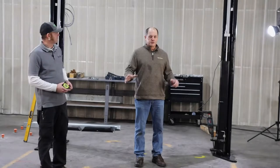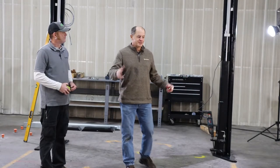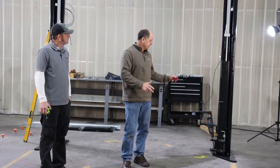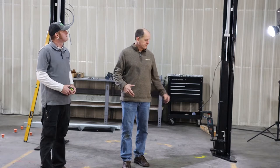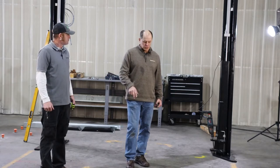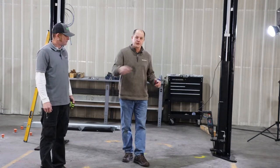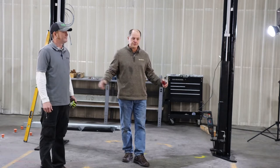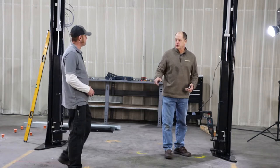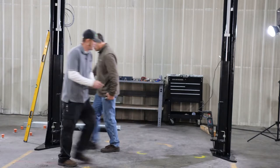The columns are now in place. This is our R&D facility so the anchors are already in — we're cheating a little. It's set at 124 inches. Walk the columns up until they're as close as possible on your layout lines. Then measure across the front of the lift and the back — you should have 124 inches at both points, meaning they're parallel.